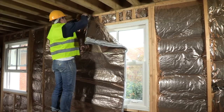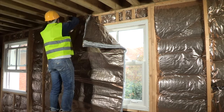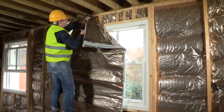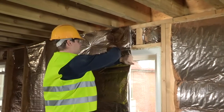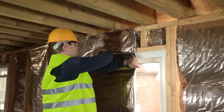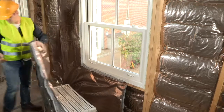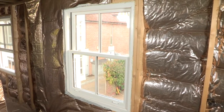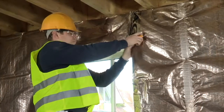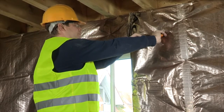Fix H-Control Hybrid to the structure using 20mm galvanised staples. Cover approximately half the window and staple above and around the window perimeter. Accurately cut away the product around the window with an Actis cutter. Repeat the same operation with the adjacent layer on the opposite side of the window.